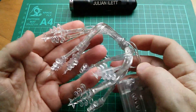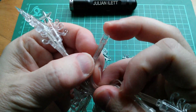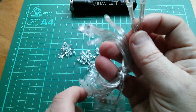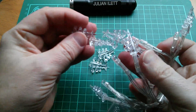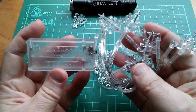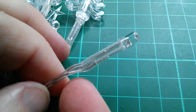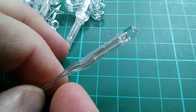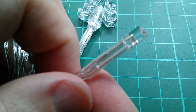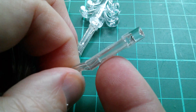Well you get 12 LEDs. These are flat top LEDs and you get 12 of these little Christmas tree press-on things. You also get a battery box. Now I'm going to see if I can find the resistors. Well there are no resistors in the LEDs themselves. You can see there are four wires - two coming in and two going out to the next LED. So they're all in parallel, soldered directly to the legs of the LED.